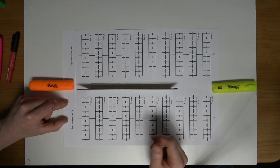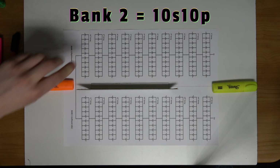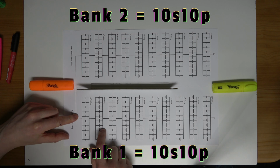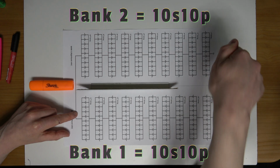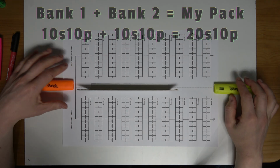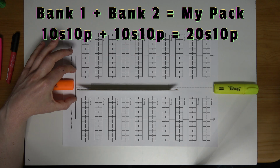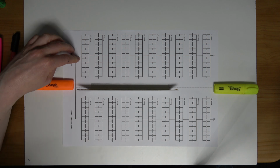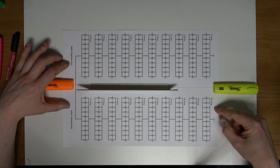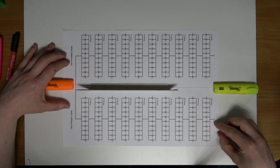So what I have here now is 10 parallel groups at the right hand side of the battery pack, and I also have a mirror image, so I have 10 more parallel groups on the left hand side. So I'm calling this bank 1 and this bank 2. So when I say I have the rear end of the bike here and the front end of the bike here, I want the series connection where bank 2 and bank 1 are joined together at the higher end of the bike. I want the terminals of the battery closer to the wheel. So as you can see here, we have the 0 volts on the right hand side, and we have the 72 volts or 84 volts at the left hand side.